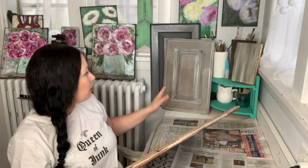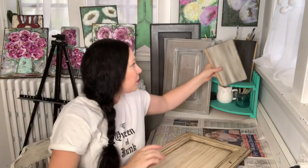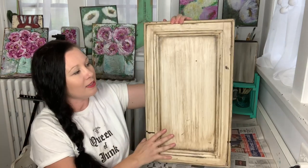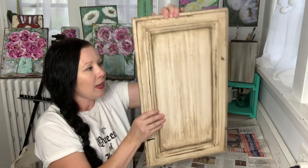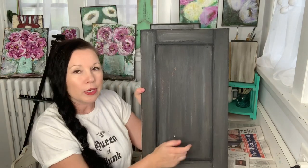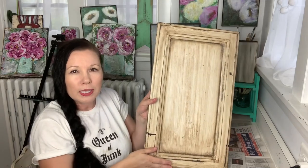This is a door I have here — you can see I have cabinet doors behind me because I'm always doing samples and showing you fun techniques. I'm going to show you how to do a solid basic paint job today, but you can have so much fun with it. This particular door was an old sample door that I did so many things with — at one point it was antique lace with some brown glaze over it, very shabby. So grab that sand block. You're not trying to sand off the top layer on your cabinet. Rather, you're just trying to rough it up a little bit to be more accepting of the paint job you're about to do.